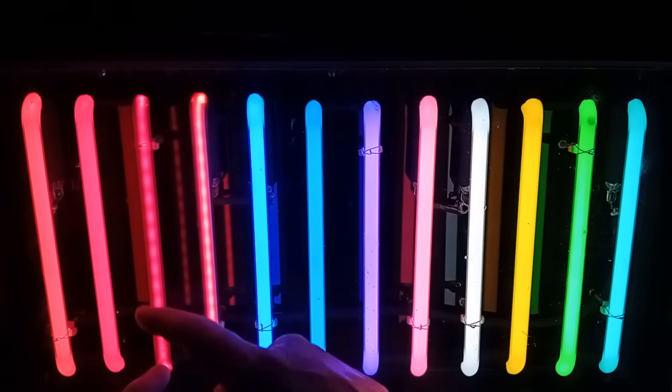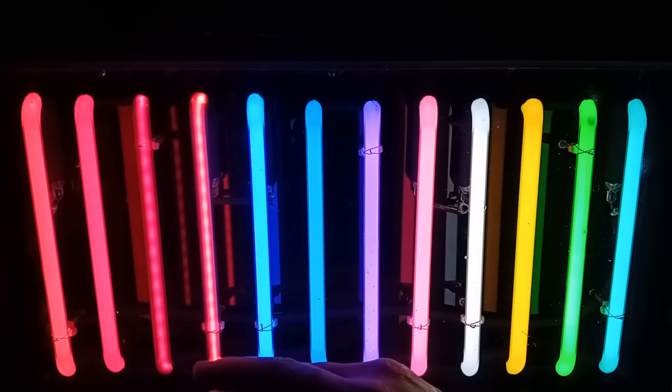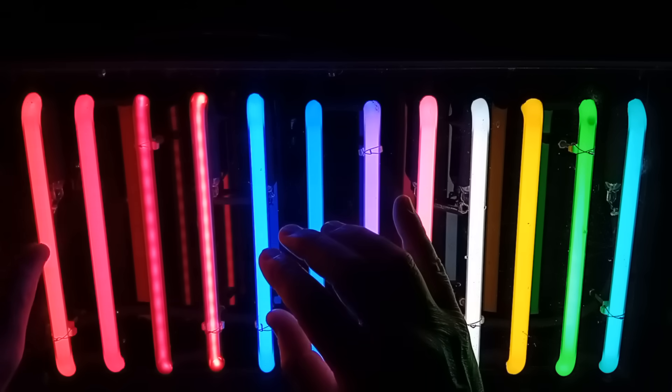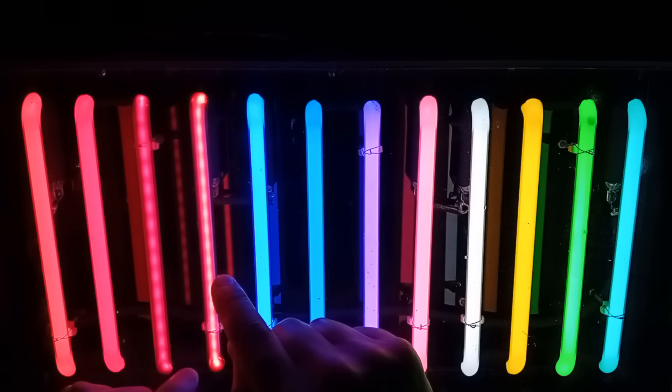Then we've got the red glass with the Neon and the clear glass with the Neon gas in it, and you can see a slight pattern running in them. That's called jellybeaning. It may be something to do with the standing wave. It's something that happens with electronic transformers, and there are dedicated electronic transformers that let you fine-tune to cause that jellybeaning effect deliberately.